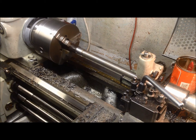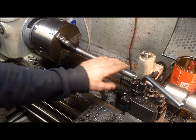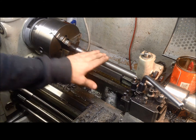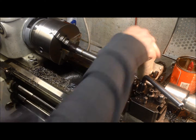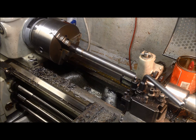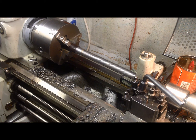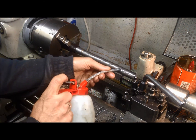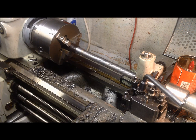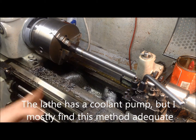After selecting the gear again, I'm still not deep enough to alter the dimension on the nut yet, so I don't need to set that until I get very close. Then I'll go in to where I have my zero mark on the cross slide. I'll take one more pass, squirt some oil, confirm low gear, snug infeed, and check everything is set correctly.